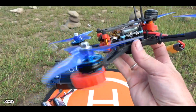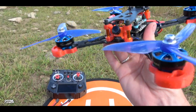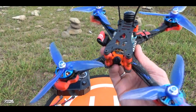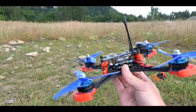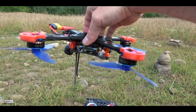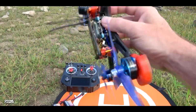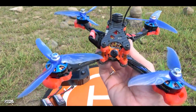It did slip a couple times on the yaw axis, so you guys could probably bring these yaw numbers down on the D starting first and then move over to the P, bring those numbers down just a little bit, and it won't be quite as sensitive. They might have it set just a little bit high on the yaw axis. When I was coming around inverted, it would just kind of wander a little bit. You could see it in the video if you back it up, but that's one way to tell if it's set too high on the yaw axis, that you have a little bit of wander coming back around, because the accelerometer will start to flip out a little bit.